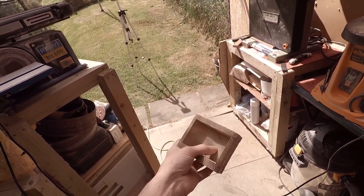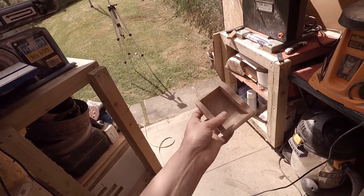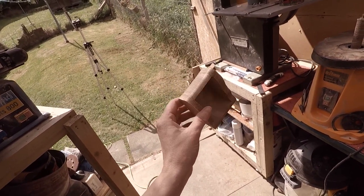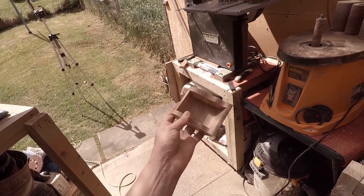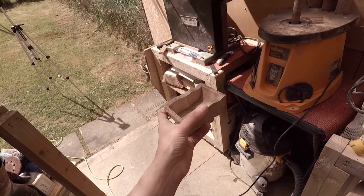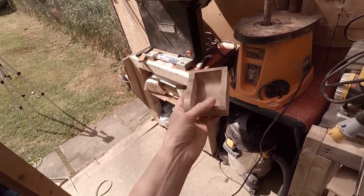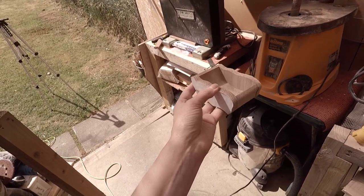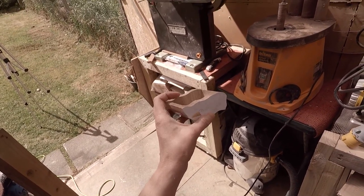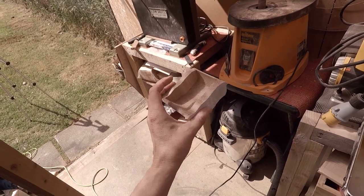The insides of the boxes, they're pretty smooth after the cutting of them, but I just give them a rub over with something like a 600 before I sand seal, and then a 600 after. And I don't tend to line the boxes anymore, the inside of the boxes, because this is oak, and when you're using nice woods, I think it's a shame sometimes to cover those. If I had a particular customer that asked me to do it, then I would line them with Suedetex, which is just flocking.